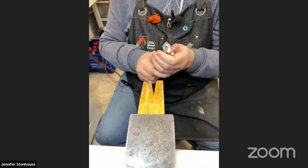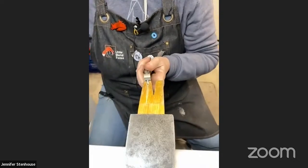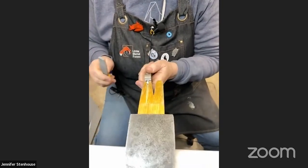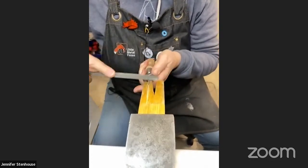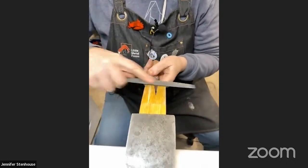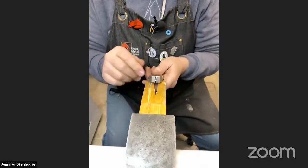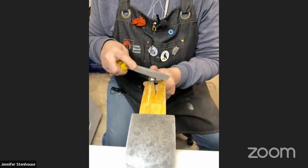along that narrow edge. Right. So if you've got something that's got a little groove in it like that, you can use your file and just file that in. This way I can rest my tool here and just file straight across and just turn. Because it's sitting in that tapered groove, I can just turn this and it'll give me that nice point. Right. If you're drawing wire, you have to file the point on the wire practically every time you pull it through.